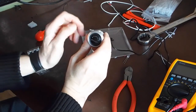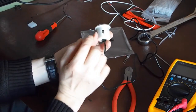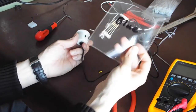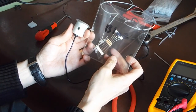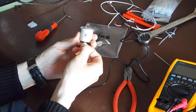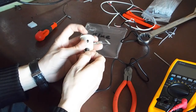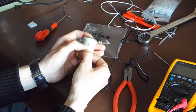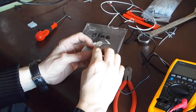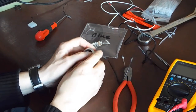Right, gonna have a plan now with this sort of start light here, or switch. What I've done, I've just put in a small hole and milled in a little slot there, and then I have these LEDs that Sean was kind enough to give to me when he supplied me with the marquee light and the appropriate resistors. So what I'm going to do is just carefully insert one into the actual switch itself, and just hold that in probably with a little bit of hot snot or something, and then hopefully I can get the threaded locking nut on, and we can sort of go ahead and use this, and it's going to light up and look pretty good. So that's the idea anyway.